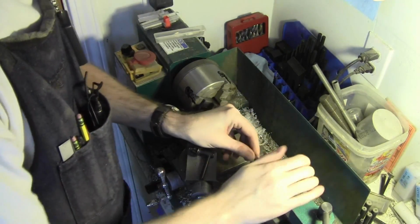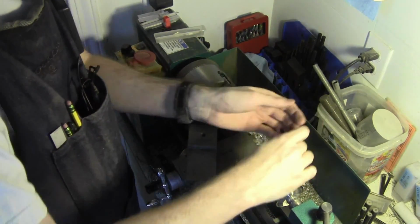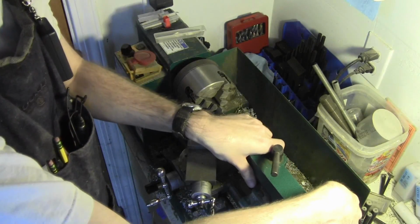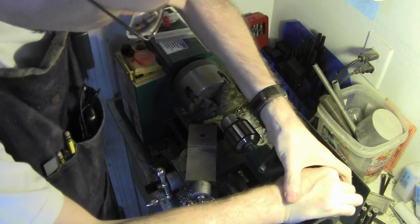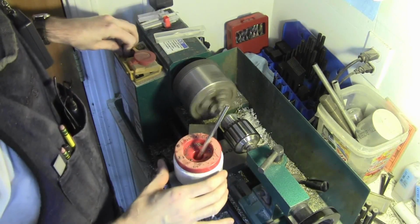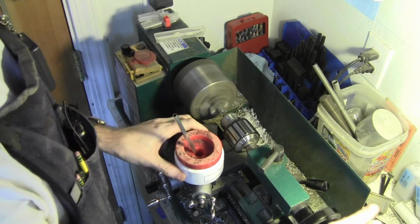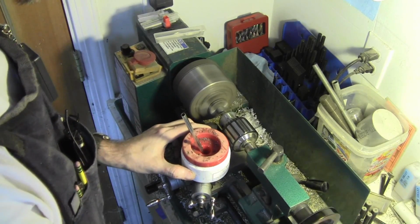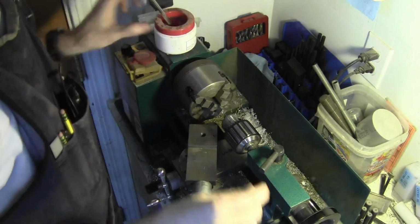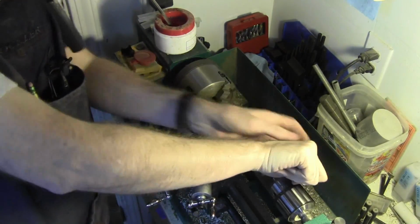I'm just going to drill so I can tap for a 5/16 tap. And first we'll do this little spot drill, center drill, to get it in the right place. Tighten that down, speed. We definitely want some lube here. Speed that up nice. Drilled. I've got too much crap on my headstock here, so I'll put stuff down. Okay, chuck key again. Sorry about the arm.